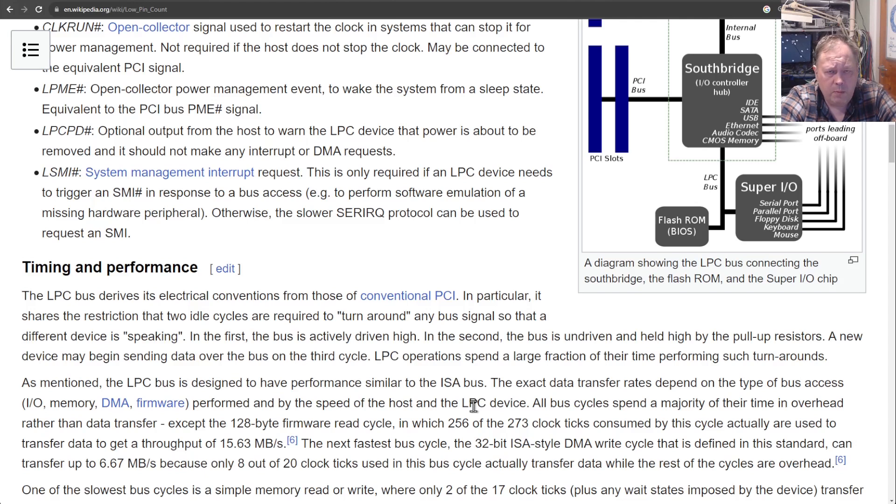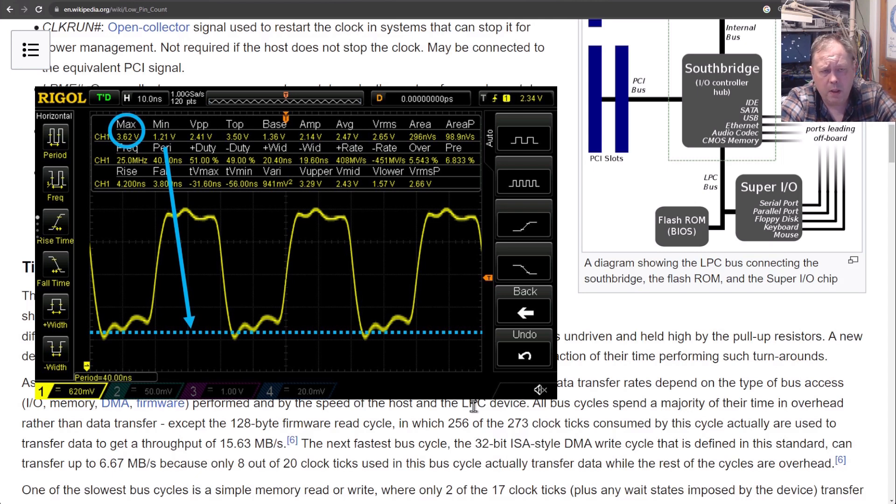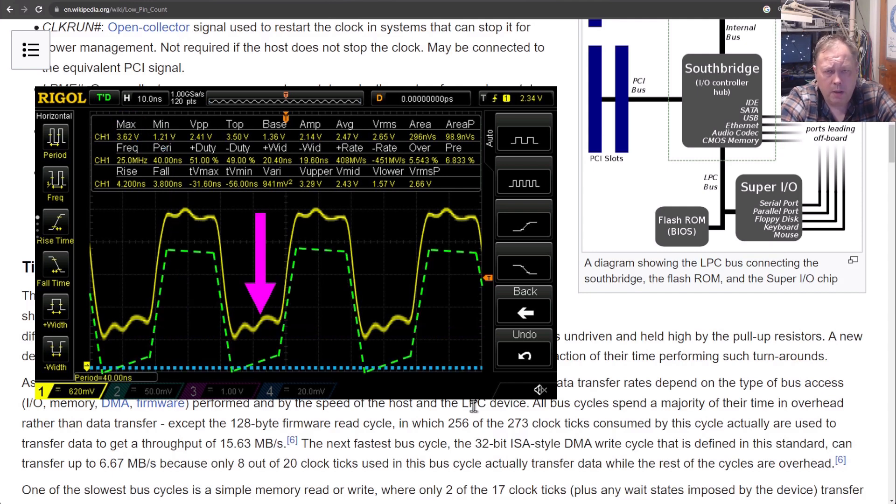Now let me present some information not covered in my previous video. I took a scope picture of this signal and, as you can see, the signal is about 2.6 volts but is coupled almost all the way to the top, meaning the bottom part does not reach a low level. That's why I connected the resistor to ground. Most of the faults I've found — not Synology — are supposed to put this to ground. Some Synology and QNAP units use a voltage divider to put the signal more in the middle, but I see no reason for this; the signal clearly needs to be clamped to ground.